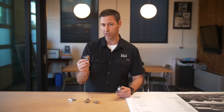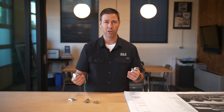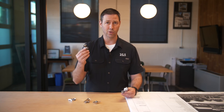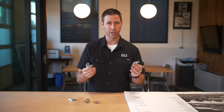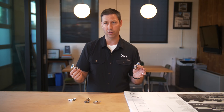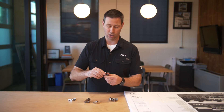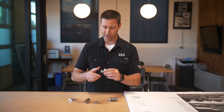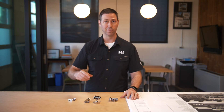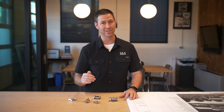The ball valves are probably still going to be in the $7–$8 range, so that's certainly going to add up. In a standard single-family home, you need two of these for every sink, one for the toilet, one for the ice maker — the difference in price between these might add up to $50 or $60 in the end. But I can tell you it's definitely worth it to get that quarter-turn ball valve. It's going to be much longer lasting. Very impressive and very cool to cut these open. Thanks to Jordan for giving me that cross-cut so we could actually point to the differences.